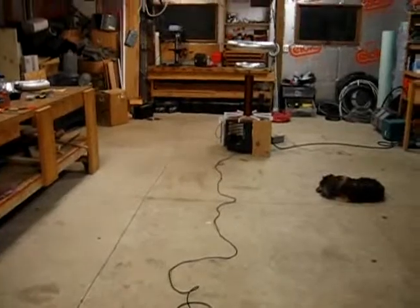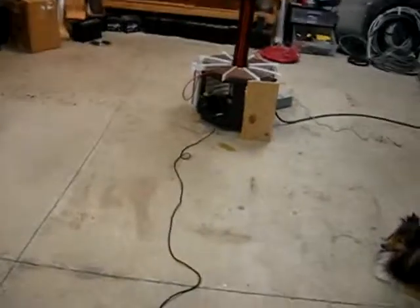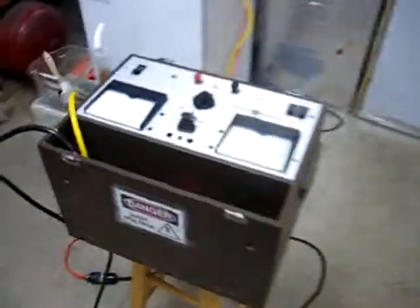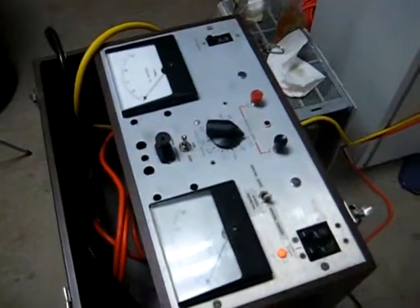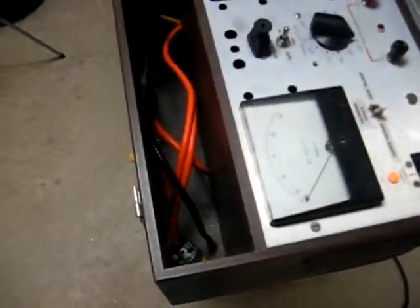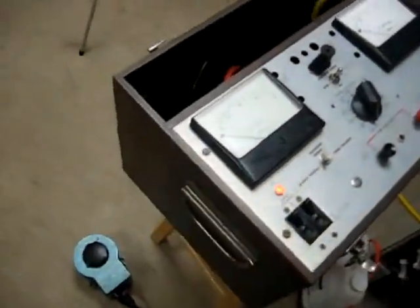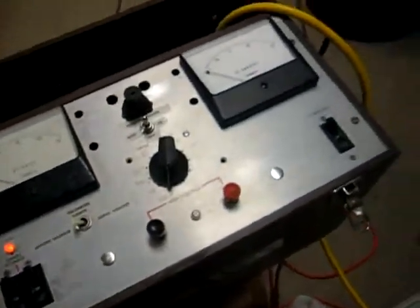I would use that for the vacuum gap, but unfortunately that vacuum cleaner motor will easily draw 15 amps by itself, so I can't run both of those off the same circuit. But you could use that to interface with some other interlock fed off of a separate circuit. I used to have a separate input just for that circuit, but then you needed two power cords or two outlets just for the control panel, and I thought that was kind of silly. So it's just there in case we need it. So that's where we stand as of tonight.